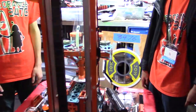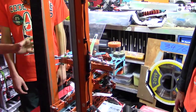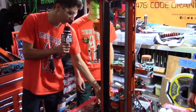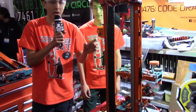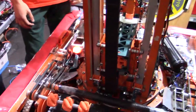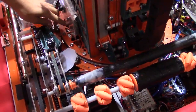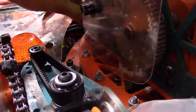So on the turret, when we first were doing design meetings, we decided that our perfect cycle — the driver wouldn't have to spin the actual drive base at all. So we decided to do a turret. If you look down here, we're running custom Nexen sprockets that we CNC routered, along with our gear mechanism. It's V-groove bearings, and we routered a chamfer on the plate so it runs into the V-groove bearings. Each individual pinion is running on its own bearing, so it's not like a lazy Susan where there's a lot of backlash.